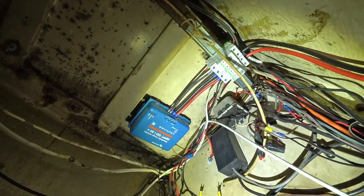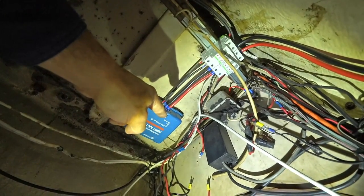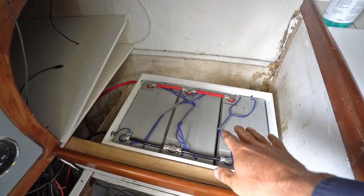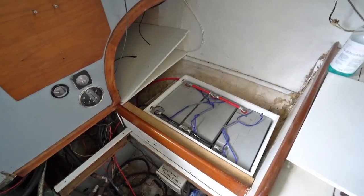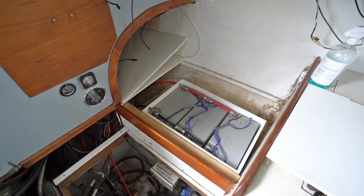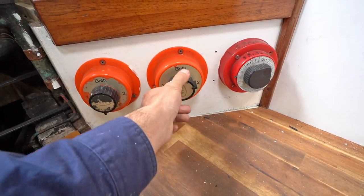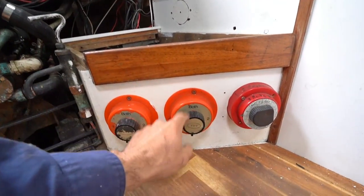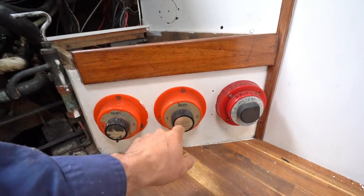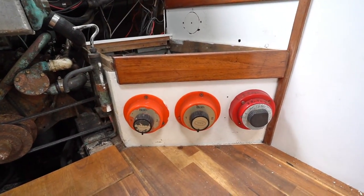There's our setup — we've got the panels coming into the breaker, then into the controller, then out of the controller into the breaker and to the batteries. We've got three on this side and three on this side under the bench, hooked up in parallel a couple of days ago. I've allowed them to balance — now all the batteries are balanced and the voltage is exactly the same. Each bank runs to this isolator here, so you can choose bank one, bank two, both, or off. I'm going to run the output from the charge controller to the feeder on this isolator so we can choose to charge bank one, bank two, or both at the same time.